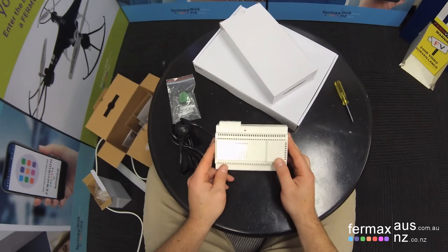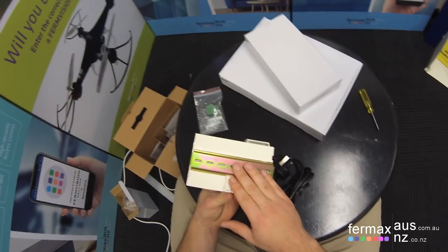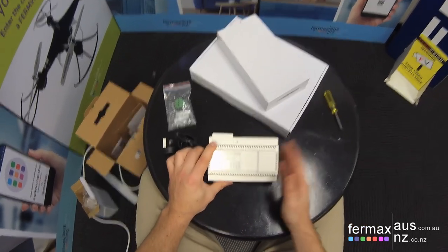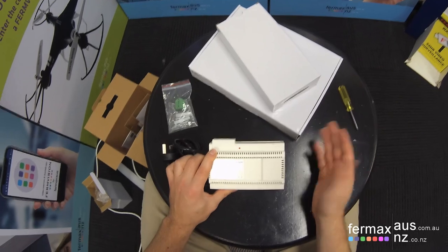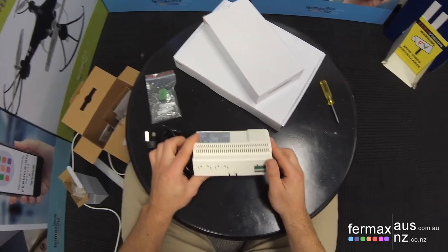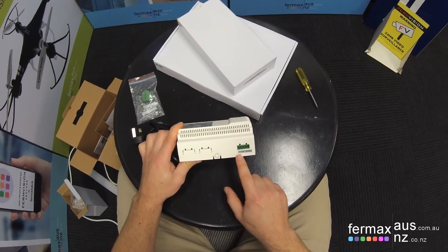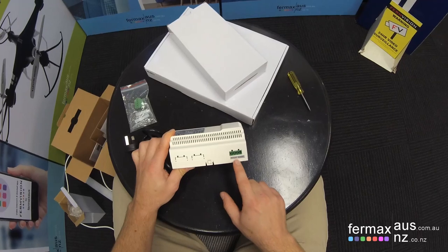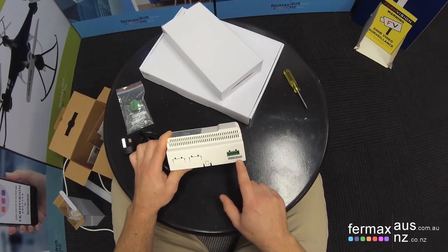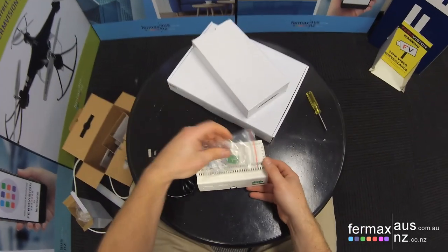so this is the power supply unit for the system. It comes with a DIN rail mount if need be, and this one power supply is capable of supporting four door stations or four internal monitors. The green plug is connected down the bottom here. You've got bus IM and bus DS. Bus IM is for the internal monitors and bus DS is for the door stations, the system being a two-wire system.